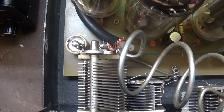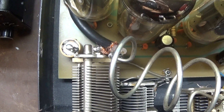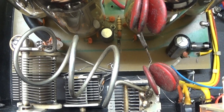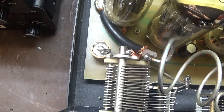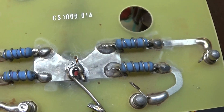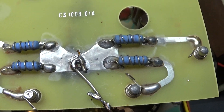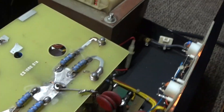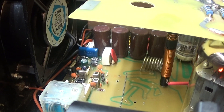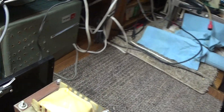All the ground connections have the paint scraped off on this one and the screws tighten down real good with a star washer — no more glitches and mess-ups. Also the load capacitor there, that big one to the left, used to be a small one like these other two, and it had arced out causing some other grief in this amp. So I fixed that load capacitor with a much bigger one with wider spacing — shouldn't arc again. The plate choke had gone but we rewound it and put tape over it.